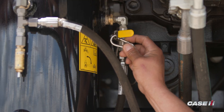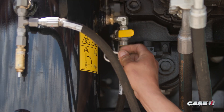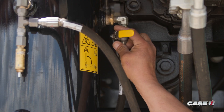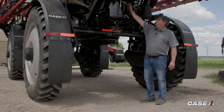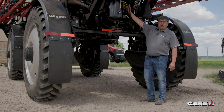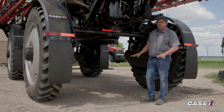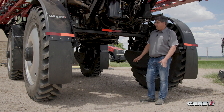What I have to do is take the safety clip off. Once I've taken the safety clip off, there's a locking handle on the quarter turn valve. I would push the valve up and that's going to release the air on the suspension system to allow me to put it on my tender truck or highway tractor truck so I can transport it and safely chain it down.